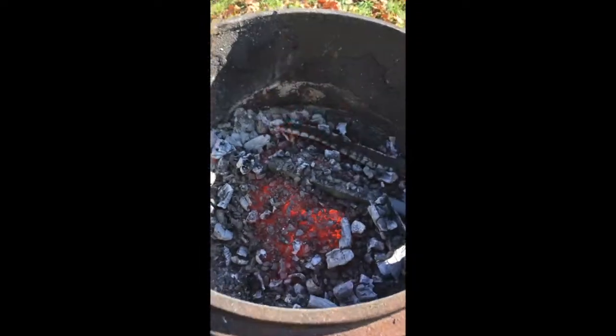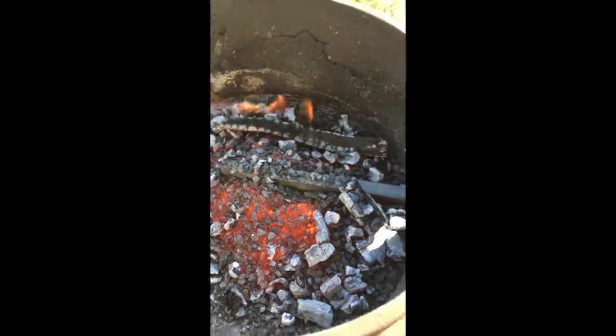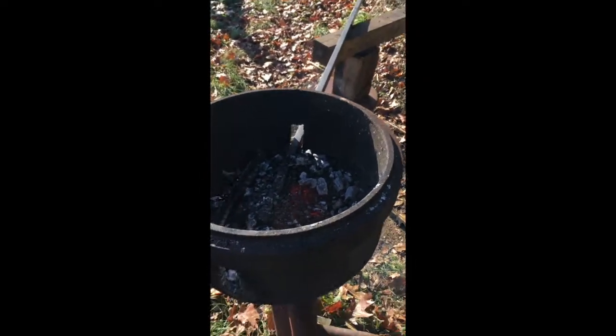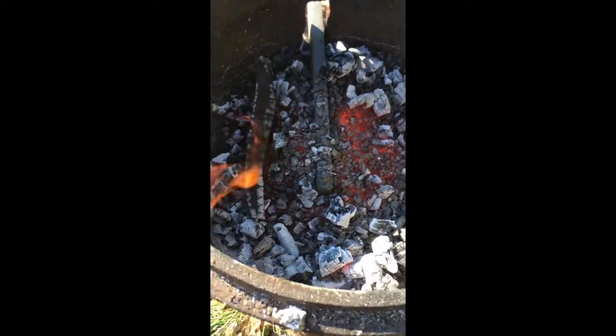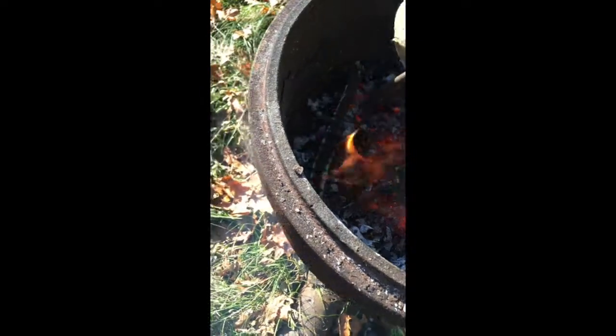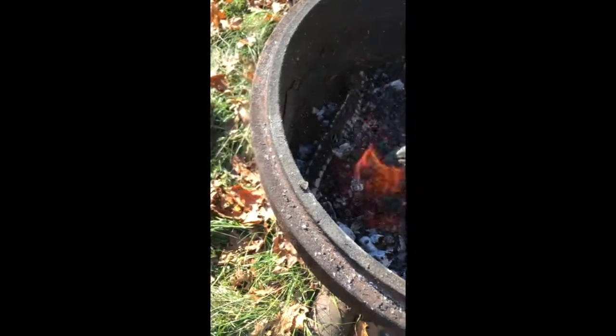All right, folks, here's the beginning of how an ornamental railing is made. I film the process of bending a 1.5 inch by 3/4 inch bar stock. Metal was heated up with a homemade 18-wheeler brake drum forge I made a few years ago, and I just fired up some Reading, Pennsylvania coal, so here it is, enjoy.